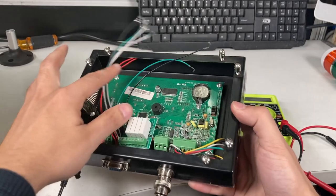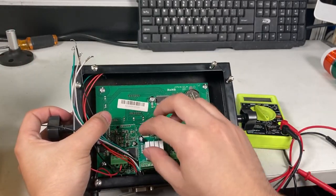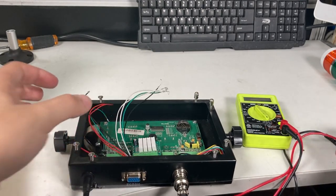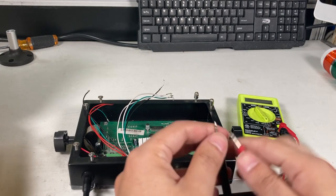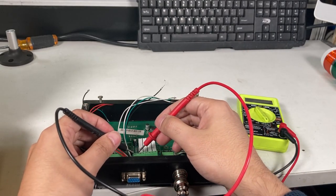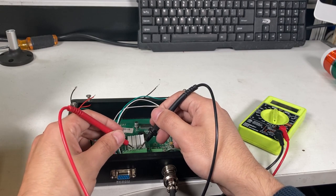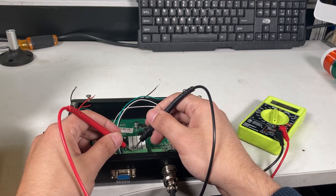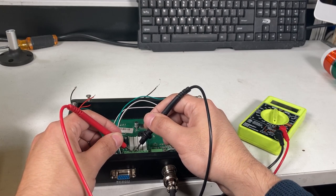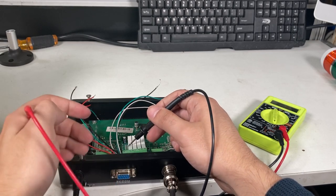I remember this board, trying to figure out on the relay which two pins are the ones being shorted, so it would actually close and have continuity. That's actually what we're banking on. So if you test this, you'll hear a beep. And it goes in pairs, they're right next to each other. Okay, you hear it? So the acceptable light is these two pins going left to right, 3 and 4.